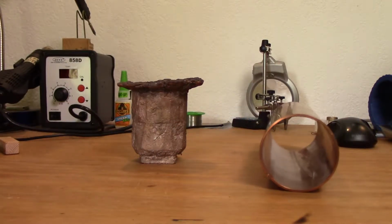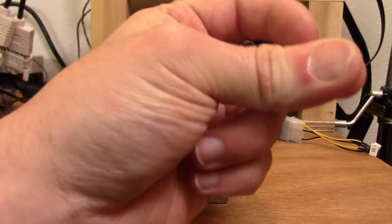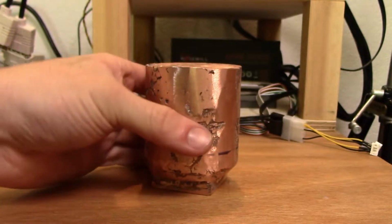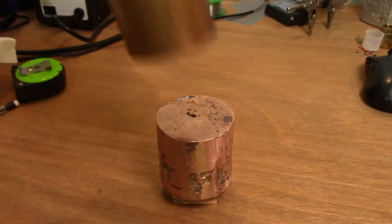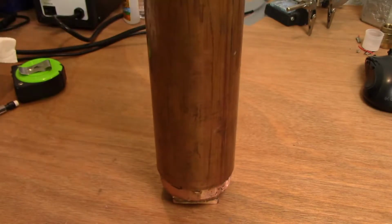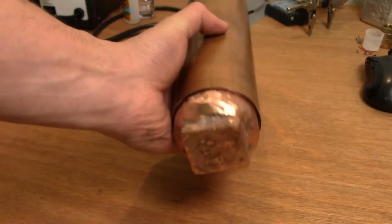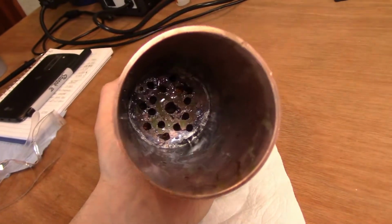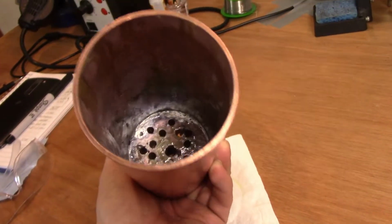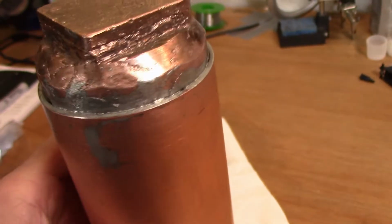But horrid works. After much work with a hacksaw and an angle grinder, I turned the rough casting into something that looked more like a cylinder with a smooth top and a flatter cold plate. It looks much better this way and can actually fit into the pipe to the required depth, but it did also reveal the sins of the casting. By sins, I'm referring to the obvious voids in the metal, not that this was stopping me at all at this point. The next step, or next 2 steps, was to drill out holes at the top of the core for increased surface area and soldering it into the pipe's end with a propane torch, and of course solder.